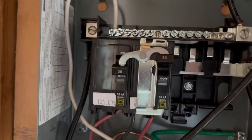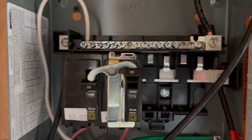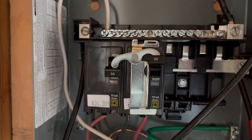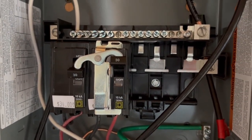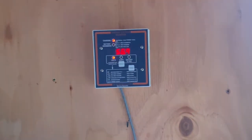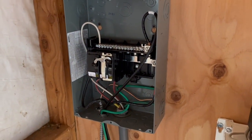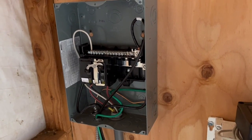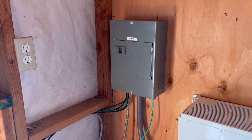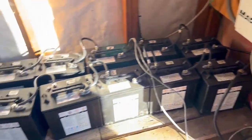This is a toggle switch — well, a breaker — for the generator on the left. Right now our generator breaker is off and our inverter breaker is on. But when you drop below your voltage, which in our case is 48, you would switch that once you have your generator hardwired in — then you'd fire up the generator and away you go. We're pretty excited because our system is pretty well all put together now.